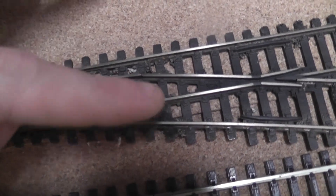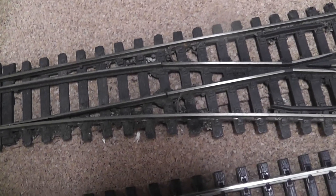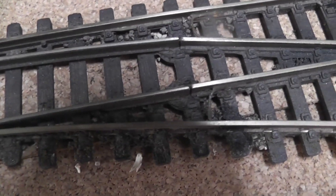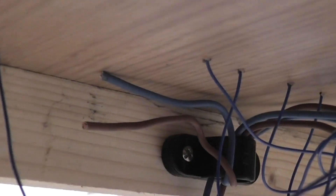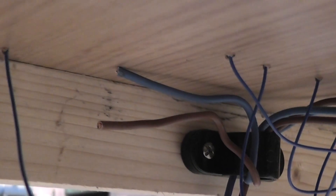On top of that, once you've done that, you need to connect the two rails together here because the frog is insulated with plastic. Hornby makes some little clips that allow you to do that - they just clip in, they're called DCC point clips or something. I haven't got any of those, so what I did was I just got a little piece of wire, bent it to the correct shape and just soldered it on. Somebody also asked me about terminating the bus wire - what do I do with the end of it? At the moment while I'm in the middle of wiring everything up I've just got it cut and pointing into an area where it shouldn't cause trouble. When everything's sorted I will insulate the ends with a little bit of electrical tape, heat shrink, or a rubber grommet. It doesn't really matter what you do as long as they're tidy and out of the way.